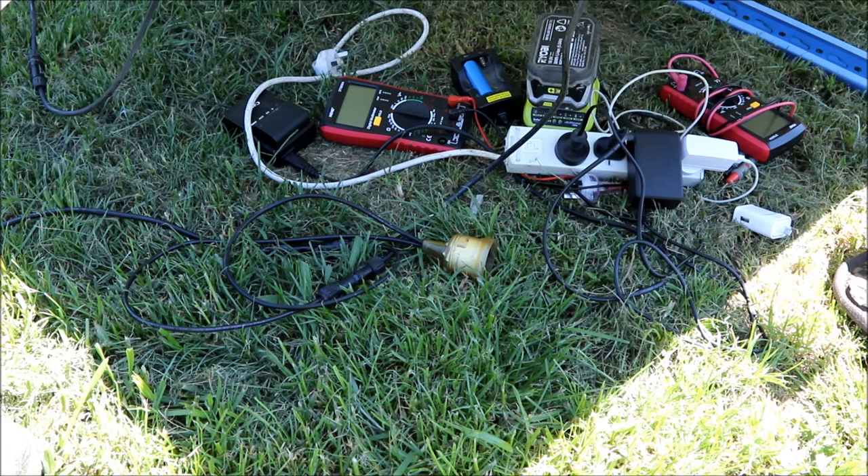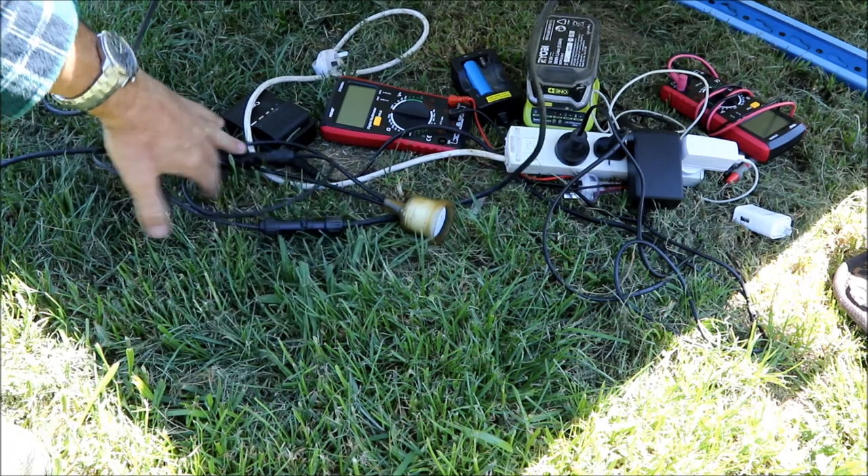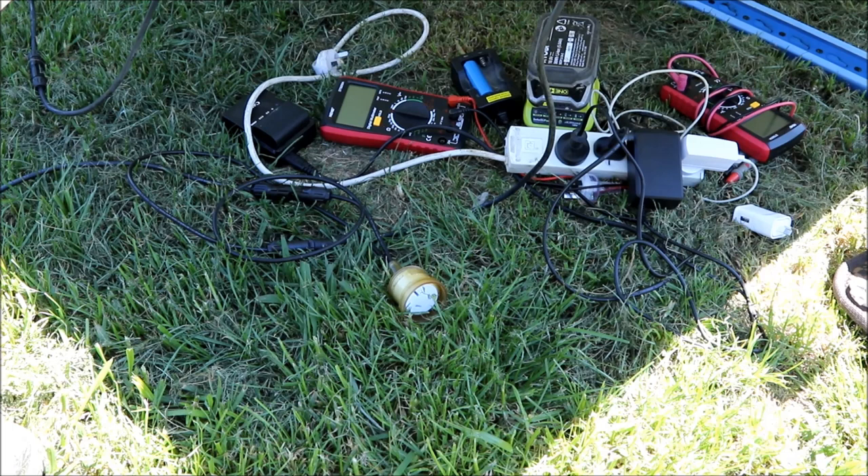It's a little bit odd because AC goes both ways, but it's obviously up to the internal setup of the different appliances as to how they work. A lot of these things are switch mode power supplies, which means they are basically electronically rectified. As I said, we have 240 volt power but I'm only getting about 131 with these panels. If you were from the States or somewhere that had 110 volt, it'd be much easier to run fewer panels and still get full voltage. I've done some tests and it does tend to work pretty well even at more or less half voltage, so we'll see how we go.